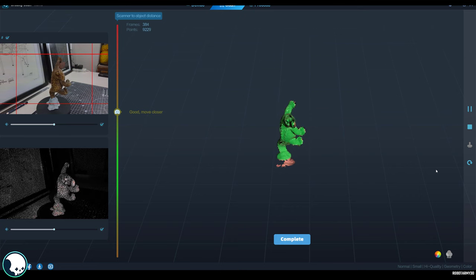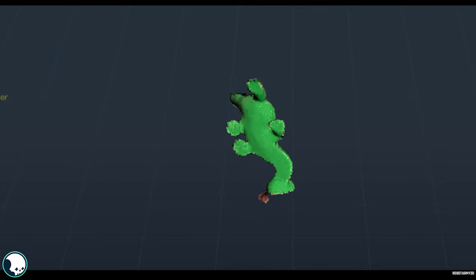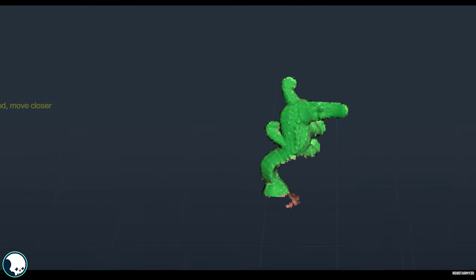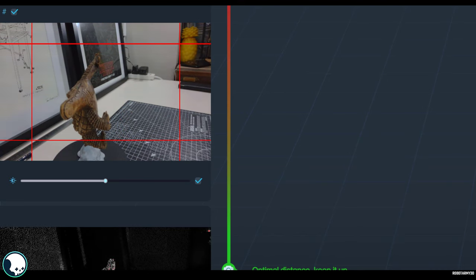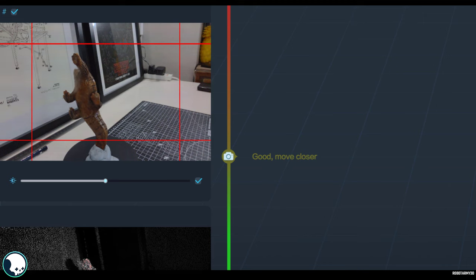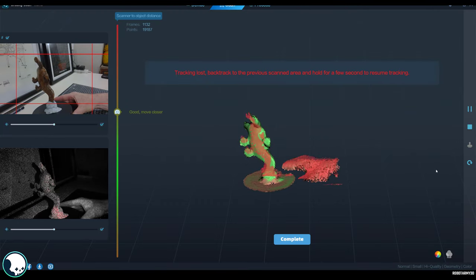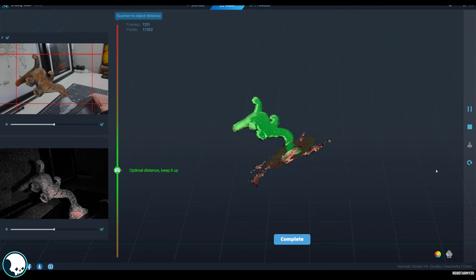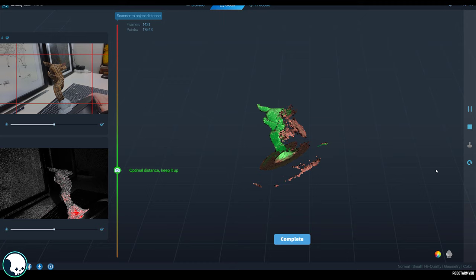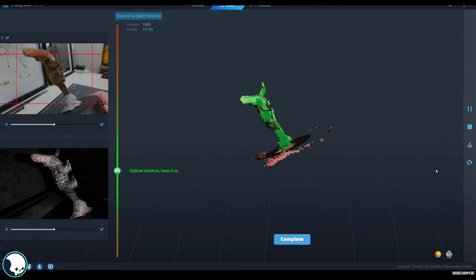It's obviously not picking up the top side of his cheek very well, so I'm going to lift the scanner up to try and get the little bits I've missed. I'll wait for it to spin around a few times until it's nice and bright green so it has a really good idea of the shape, and then try to catch the bit we missed at the top. It's also not getting the underside very well, so I need to lift the turntable up to point that lower part at the camera. You can see there's bits of random geometry caused by my hand being in shot, but we can clean that up later — as long as it's not intersecting the actual model, that should be fine. Sometimes this is just how it goes unless you've got some way of positioning the entire setup automatically.